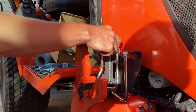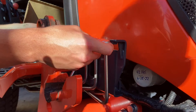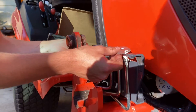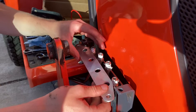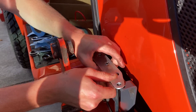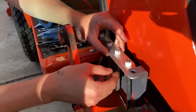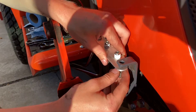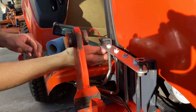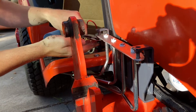What we're doing is retaining these hydraulic hoses — otherwise they're kind of just hanging around at their free will. You'll want to put the hoses closer towards the tractor. You can see it has an offset to it; this matches the spacing of the single point connector that was originally on the tractor. We're going to want to make sure that this plate is mounted underneath of these tabs, and our original bolts are also going to mount from the bottom side. This bolt back here is the reason you want a ratcheting wrench — there's not much room between this bolt and the floor.